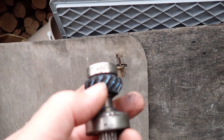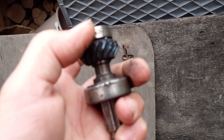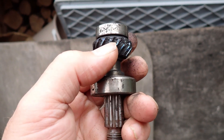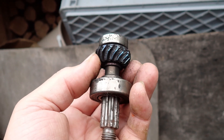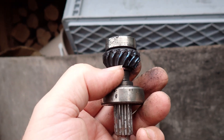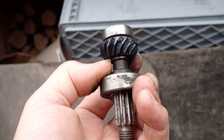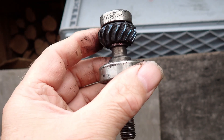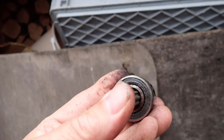This blue colouration tells you that this has been at least 550 degrees Fahrenheit, which is the temperature at which polished steel oxidises to produce this colour. There's a whole range of different colours produced at different temperatures which can assist you in tempering steel. A brown colour — you can see it here on this shaft — is a lower temperature, and a light straw colour is a lower temperature again. So this whole thing has been stinking hot.